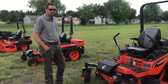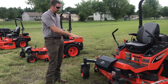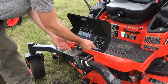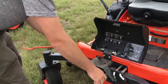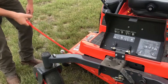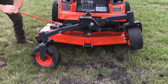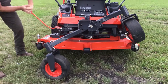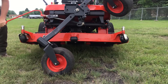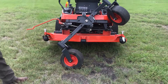One of the unique features on this mower is the ability to lift the front of the mower up to service your deck — for clean out, to change blades, or anything else. There's a crank system built into it. Underneath the shroud there's a handle that folds out, and there are a couple of pins. You lock the front tire so it can't pivot as the lift comes up, then the second pin is used as a safety, so you're able to get under there easily and work on your deck.